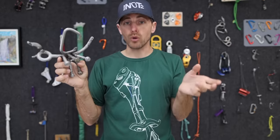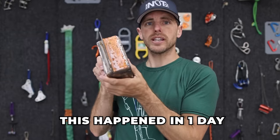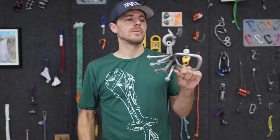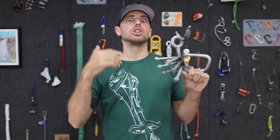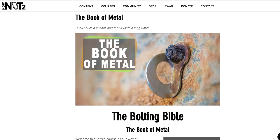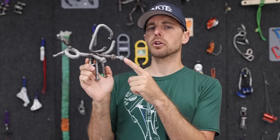Zinc-plated steel is a thin coating of zinc, which is the sacrificial coating that corrodes instead of the steel — but once it's gone, the steel will rust quickly. This bolt had no zinc on it, and you can see what happens with nothing to sacrifice. A galvanized eye bolt has a lot more zinc on it, which is why it lasts longer than, say, Tonsai, Thailand, where zinc-plated bolts broke in under six months.